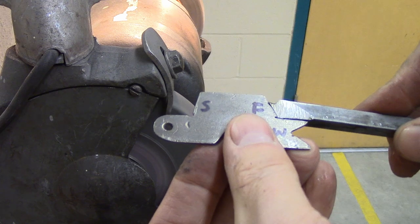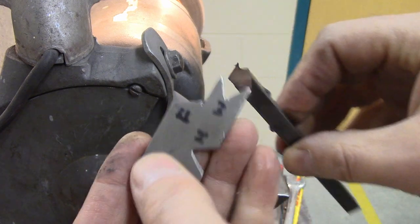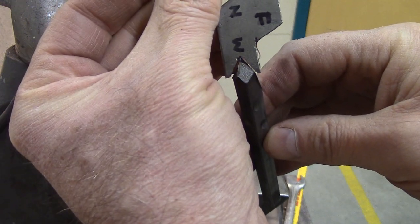That's why I give you a piece of mild steel — I don't care if it's really short by the time you're done. There's your face, there's your side. Check the nose — make sure it's tighter than 90 degrees. Check the wedge — give it a good old wedgie.